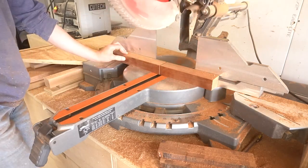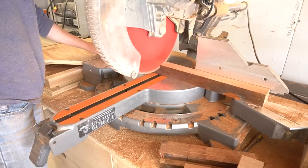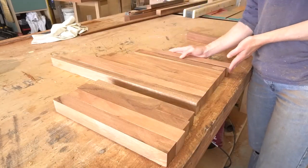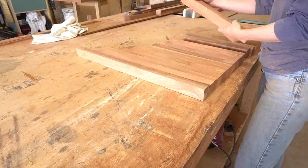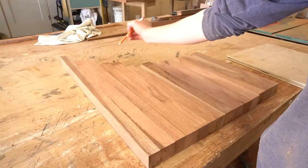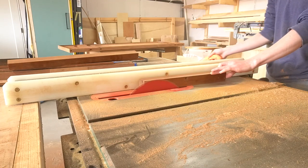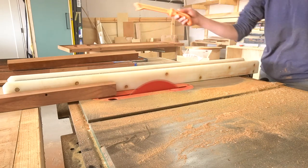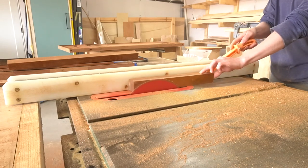So if I made a normal cutting board with the grain running the length of the board, it would have been a pretty small cutting board. I played around with the design to try and utilize as much wood as I could and decided to glue it up and use a tall piece as kind of a handle. Clearly I changed my mind later, but that was my initial thought — I was completely winging this project. Before I did any gluing, I ran these pieces through the table saw again just to barely trim the sides to remove the veneer that had been on the front and back of the door. This gave the pieces all fresh surfaces and a common thickness so that they will glue up fairly evenly.